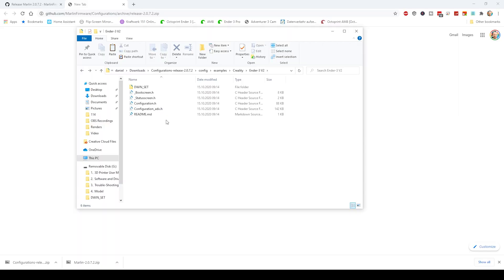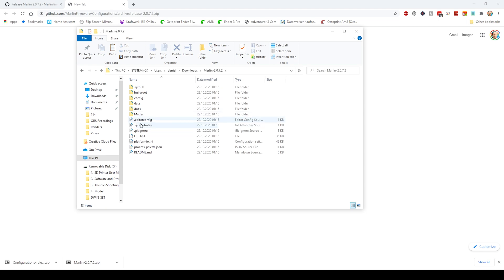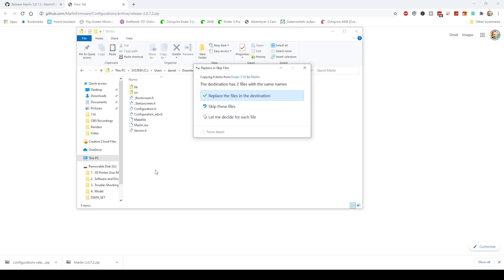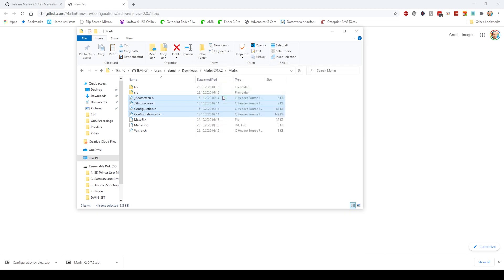So we did part 1 of the upgrade — the display firmware. Now let's finish part 2, the printer mainboard firmware. Head back to the Ender 3 v2 configuration folder and copy all files with the .h extension into the Marlin subfolder of the directory where the Marlin GitHub source files are. Don't copy those config files into the main directory — that won't work. Really make sure you put them in the Marlin subfolder. A lot of people get this wrong and wonder why their firmware seems to build for the wrong printer and why they don't see the environments they expect.